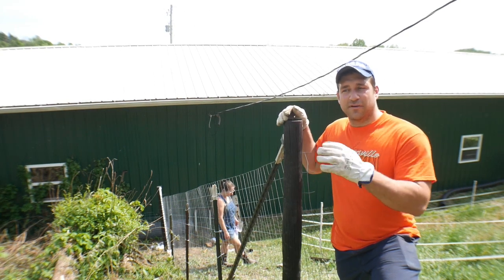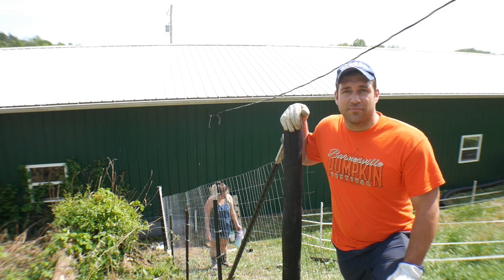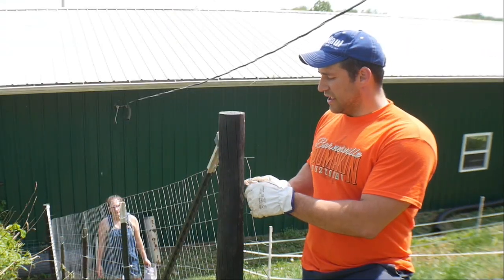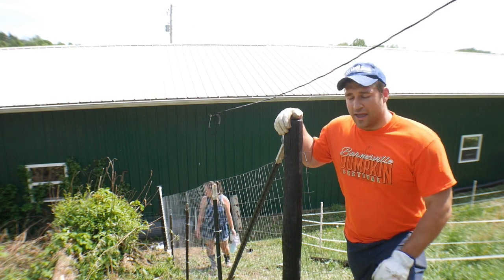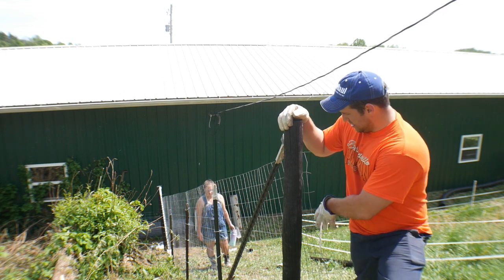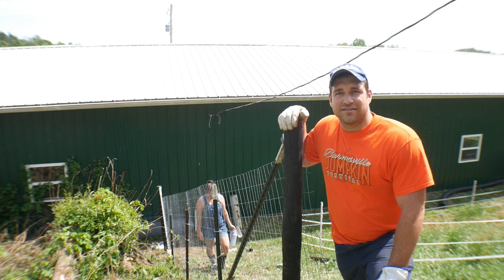Just a short quick video — I wanted to make this because I couldn't find any videos on putting this fence in on a bank or a steep hill. That's how I did it. I'm sure there's better ways, but it seems to have worked out for us on this side. One thing I will do next time: I put my first staple one link down — I should have done it on the top, I think that would have made the line straighter. So I'll do that on the other bank. After we get done, on the inside we'll take this poly tape fence down and run that on the bottom on the inside, so the turkeys and goats won't dig and go underneath. If you like this video, hit the subscribe button and the like button. Until next time, thanks for watching.